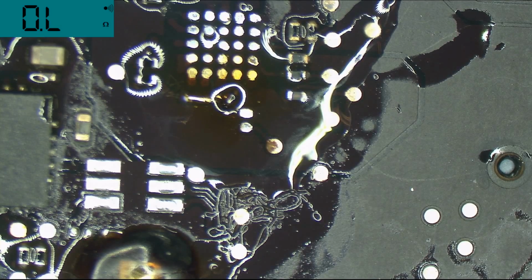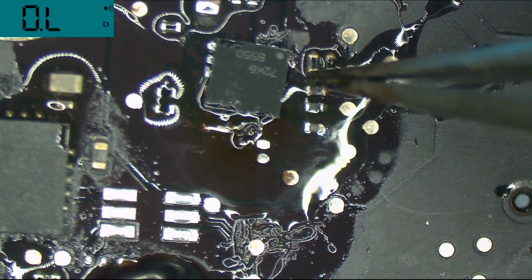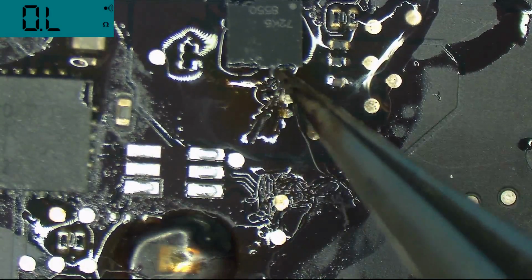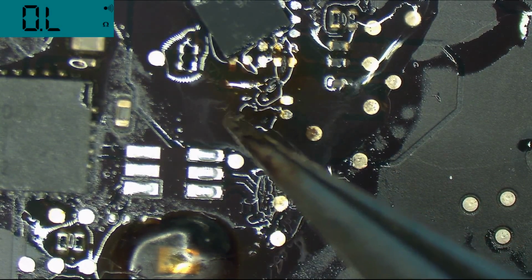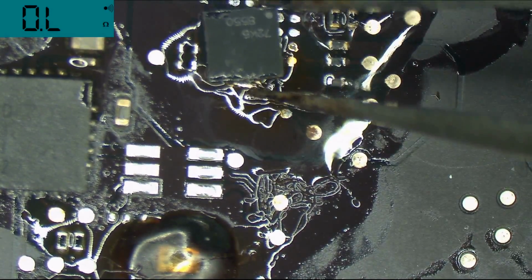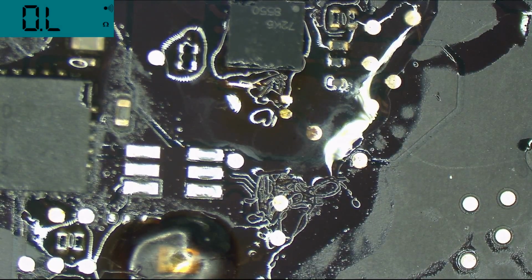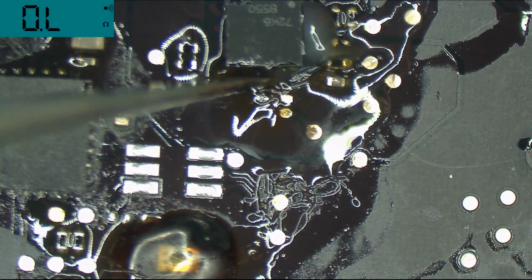Now, when you're testing the continuity and doing this beep test, just because it's going from point A to point B, is that guaranteed also? This is something I've never tested for. That it's going to have that 3 volts directly there? It should, as long as there's 3.3 volts there. It should have 3.3 volts over here, since we reconnected the break. Even if it doesn't, let's say the 3.3 volts is created inside the board, I don't even care at that point, because I can just wire it to here, which is infinitely easier than wiring it to there. But I think we already measured that we had 3.3 volts at that point prior to doing all that. Yeah, after I scraped that area, I think I measured for 3.3. So now all that's left to do is shove the chip on.